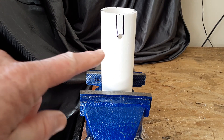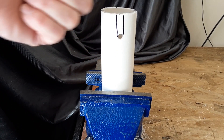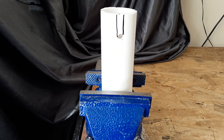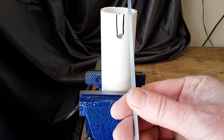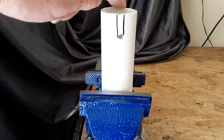Here's the next hole I drilled, 90 degrees off from the two at the diameter. I traced these lines by hand because this is the little notch that I'm going to cut out. I'm just going to use a hacksaw blade to cut it out that way I can do it at an angle and I won't cut the opposite side.